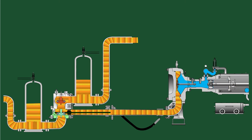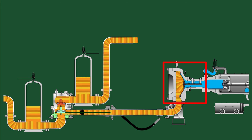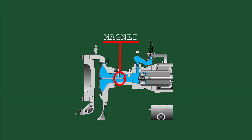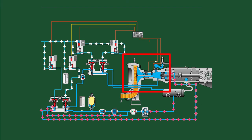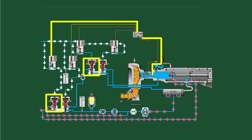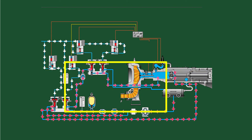To prevent the diaphragm from being damaged by hitting the back or front side of the diaphragm housing, under normal conditions the diaphragm moves within a certain range. The diaphragm rod is equipped with a magnet that actuates monitoring probes ZSH (switch high) or ZSL (switch low). Under normal conditions, the magnet moves between ZSH and ZSL without actuating them. If there is insufficient propelling liquid during the suction stroke, the magnet actuates ZSL, sending an impulse to the Geho control box. This actuates solenoid valves and pneumatic main valves, temporarily switching off flushing flow to the piston and adding propelling liquid to the propelling liquid chamber.